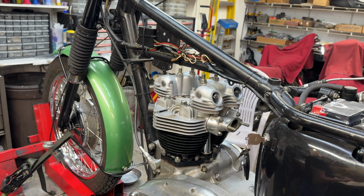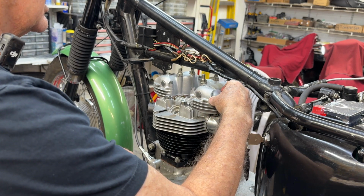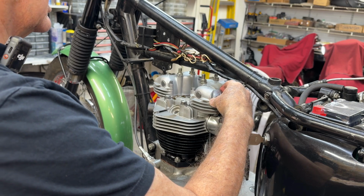Now, actually, you can get a better seal between two pieces of metal without a gasket if they are properly manufactured than with the gasket, because you have to think, remember, if you have metal on metal, you've got only two surfaces that can leak. But if you have metal with a gasket on metal, you have four surfaces that can leak. Think about it, it's kind of weird.